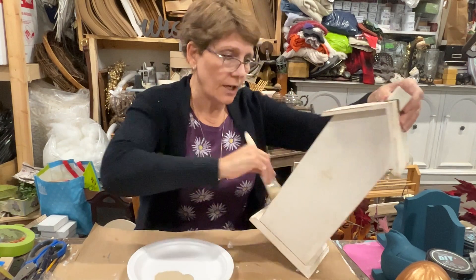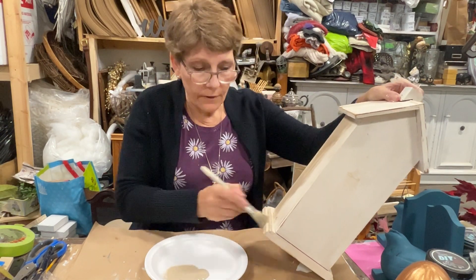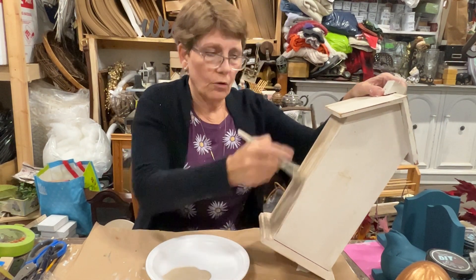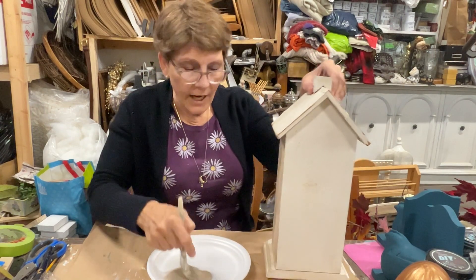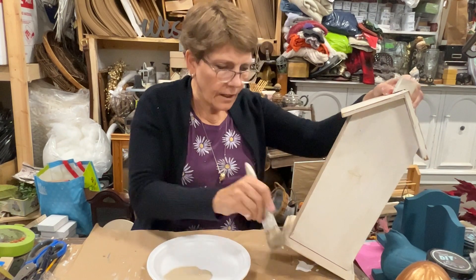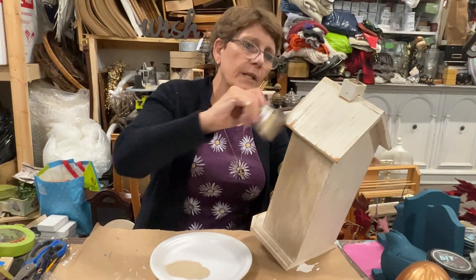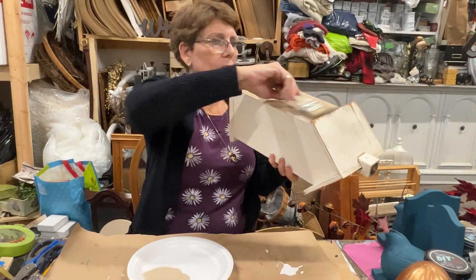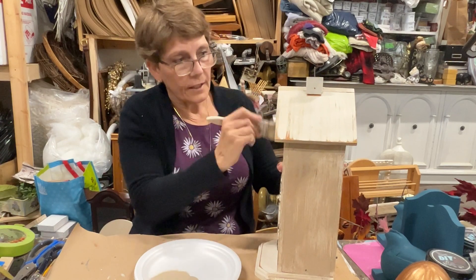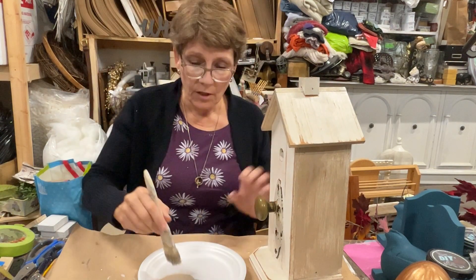I'm putting the Algonquin on first and dry brushing it — you can see I've offloaded a lot of it. This is a very slick surface now that we've got that shellac on there. I'm taking a very little bit of paint and just dry brushing it over, going a little heavier on the section where I had that bleed-through. I'm just looking for that uneven look because we're going to do more layers — I just want to get some of this color on and create a little texture for my next paint layer to stick to.